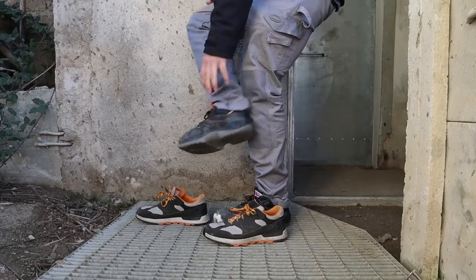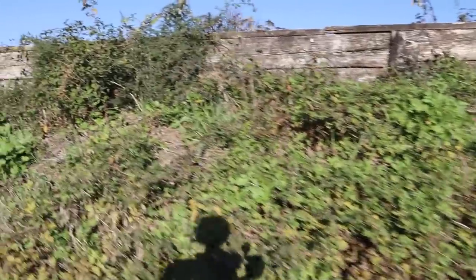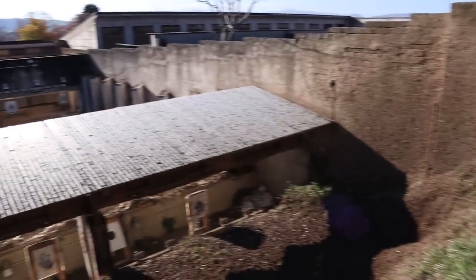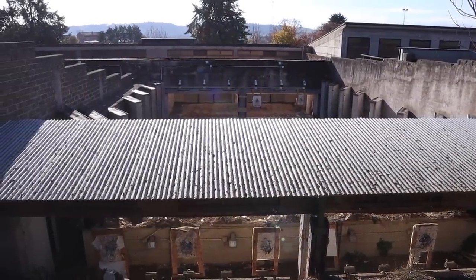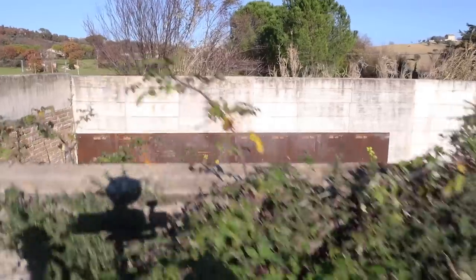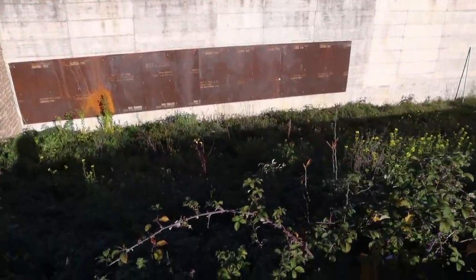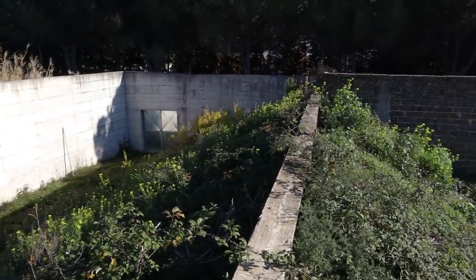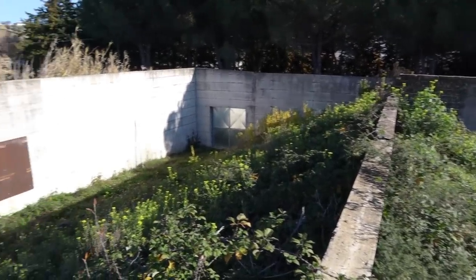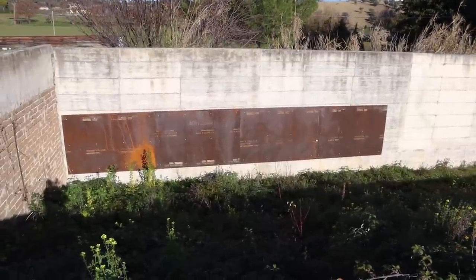I'm now going to climb over the embankment to show a few additional details and what lies beyond. It's quite a steep hill and I'm struggling a bit getting to the top, but finally here we are. Even though there is absolutely no chance that anything could pass through this much soil, a one foot thick concrete wall closes the back of the range. The embankment doesn't rest on it, since that would exert pressure on the wall requiring it to be stronger. Instead, it's usually cheaper to simply make the range slightly longer to accommodate the natural slope of the soil.